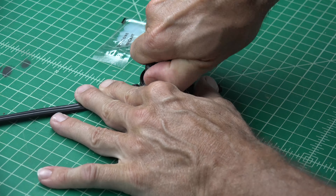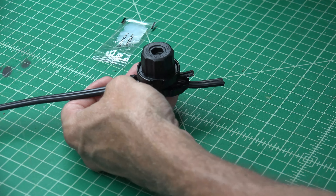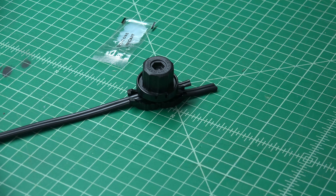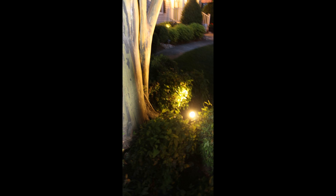With a good low voltage transformer you can ensure your yard stays lit at any time you want. I am only going to have three lights — one on the house and the other two on the trees — so the transformer I used only needed to be 60 watts. If you plan on more lights, you will need to get a stronger transformer. I have provided a list of links in the description of this video to show you the ones that I considered.